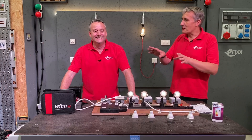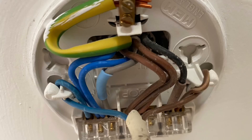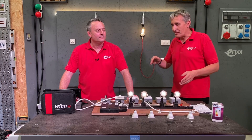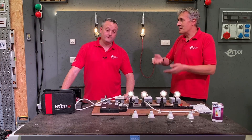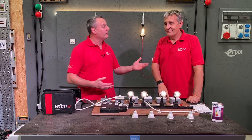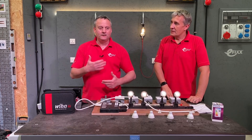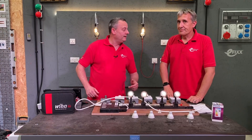Let's unpack that. You've wired the house — could be a new build or a rewire — the customer's moved in, they've changed the light fitting, and they want to set the low end. In the first scenario, they've got to pull the switch off the wall, probably damage the decoration, and trim that potentiometer live — with an insulated screwdriver. You're probably not going to recommend that one. Then that second version: they've lost the instructions you didn't leave with them, you can't remember what those instructions said, and you're going to end up jumping in your van and driving out just because the dimming pattern doesn't suit the client.